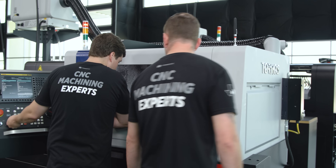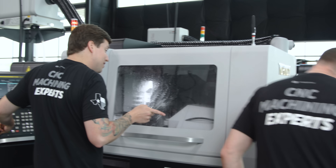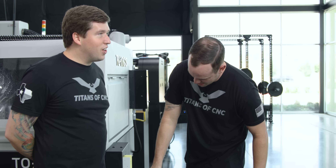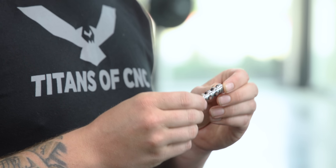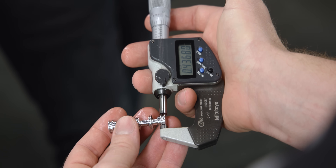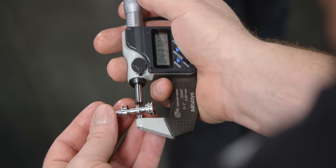We're about to find out how the final part came out. Voila — look at that! Yeah, you did your job right, it should look good, Trevor. Looks pretty good — actually, that looks insanely good. That's beautiful. Should we measure it? It should be close — only two tenths off. I just ran a couple and adjusted; I'm not going to claim I did it perfectly on the first try. Every top part should be 437. Not bad.